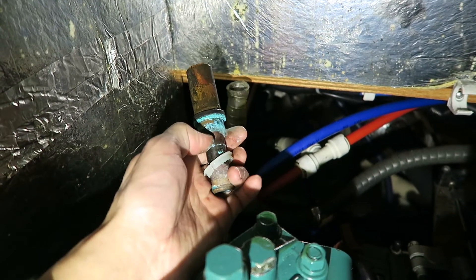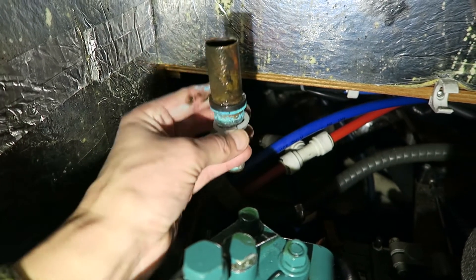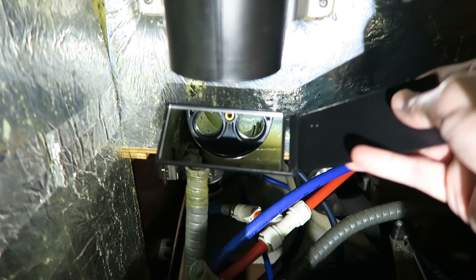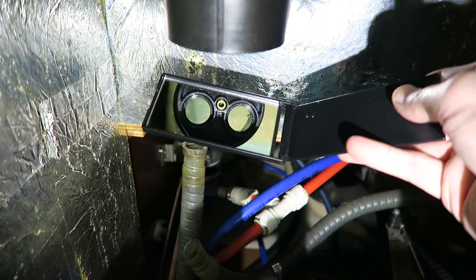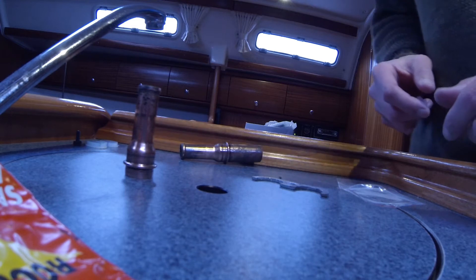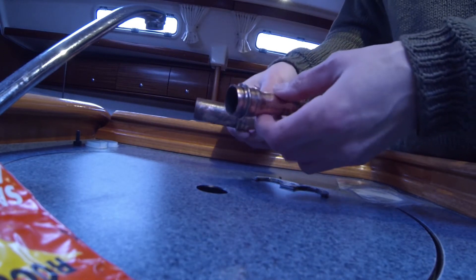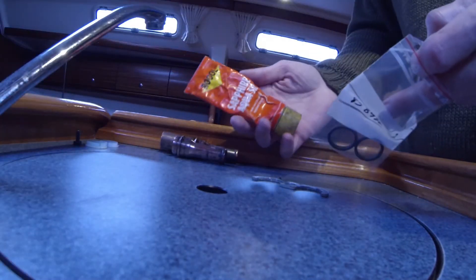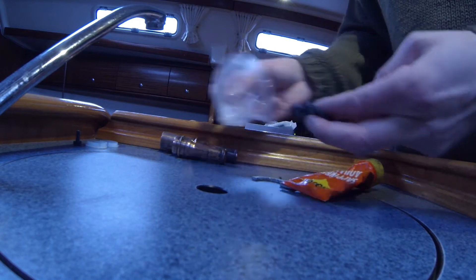There is also this plastic thing — I think it is for the metal holder in the bottom so it can hold the pipes up and seal them. I have then cleaned the holes in the bottom here so they are nice and clean and ready for the new rubber gaskets. I have now cleaned all the parts so they are ready for the new gaskets. And as always, I use this silicone grease to lubricate the rubber rings here.